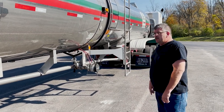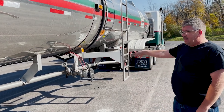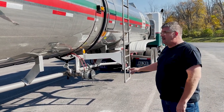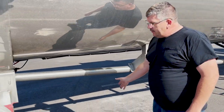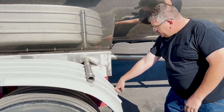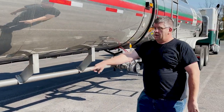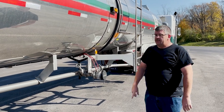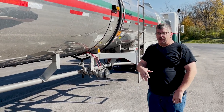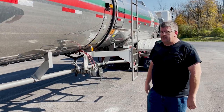And another thing you've got to watch out for too. Somebody doesn't do a good job on the belly line. There's a leaky valve, leaky API head, something like that. You'll have product that will drip from there, come back, hit the front side of this, but also go back in there and start collecting on the inside of the brake and the drum to make it look like a blown wheel seal. The only way to tell the difference is to actually climb up underneath it, look in behind the webbing and the brake shoe, and look at the wheel seal itself.